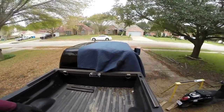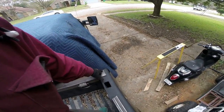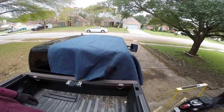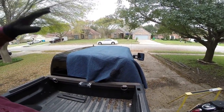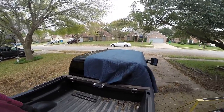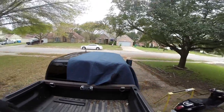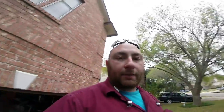We've got our two end pieces cut. I'm going to put them in the furthest out corners because this thing is going to end up centered anyway. I'm going to go ahead and tack everything on the truck. To protect the truck we've got a moving blanket on it — it should really be a fire blanket, but it'll keep it protected from any splatter. All I'm going to do is put like three or four tacks on it, and then obviously we'll take it off and do the finish weld. The nice thing is we can figure out our main runner piece on the workbench once these two pieces are tacked in place.